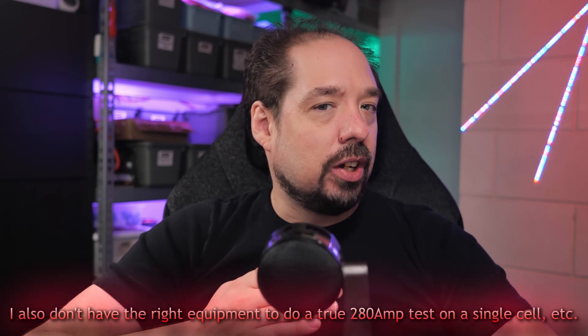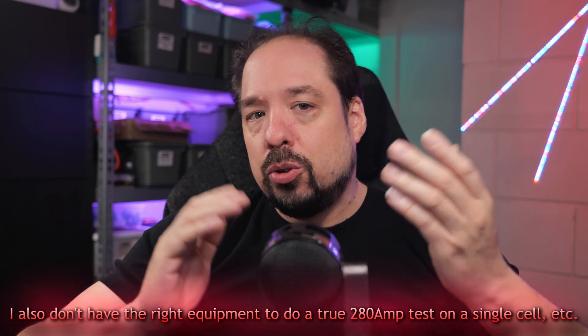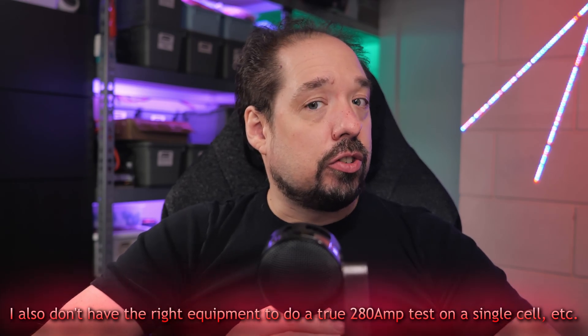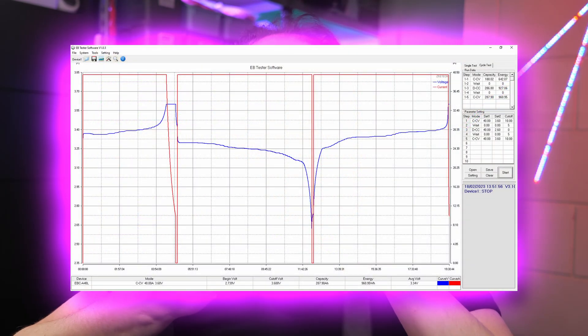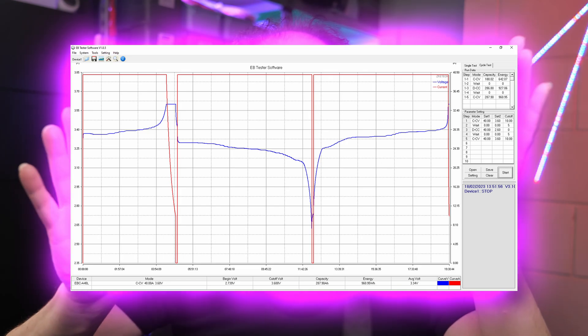While I believe the things that are said about current carrying capacity are probably true — I'm sure a true EV-grade cell might test better, being able to deliver 280 amps where a B-grade would not, or would do so with more voltage drop — I am not able to really test and compare this myself since I could never get a large enough sample size to do this testing correctly. So we'll just accept that as truth, but for our intended application, as I said, it doesn't matter too much. I have tested each cell individually with 40-amp charge and discharge loads, and they do that just fine.